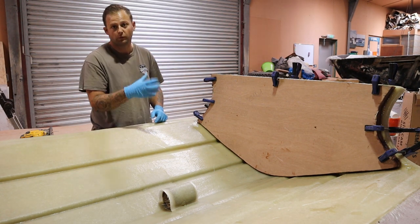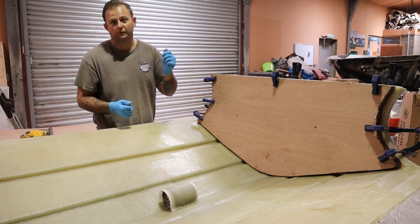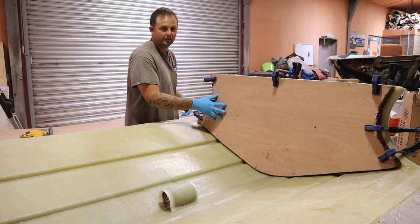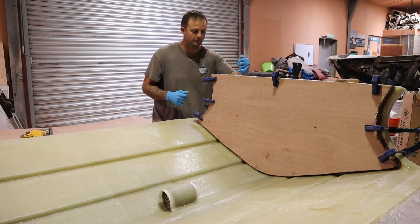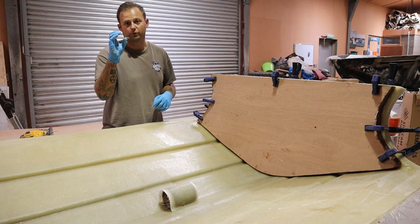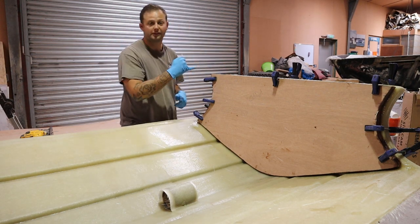So I wet the surface, wet the mat, wet the second layer of mat, wet the back of the board, okay? So then we had contact, and then the filler, and then clamp this in as well. Okay, so we clamped all around the outside, and what's actually happened up at the top here, around the outside, is the thickness of the mat is compressed now, which is then squashed, and now we've got resin oozing out of all the sides, and that's what you want to see.